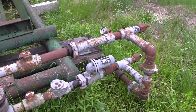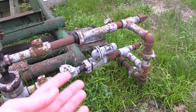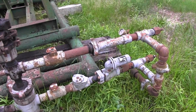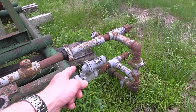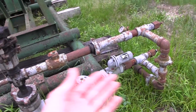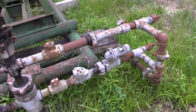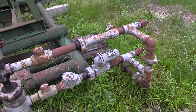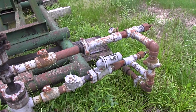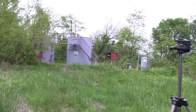This stuff can be organized in a lot of different ways, so you can have check valves in different spots. It really comes down to operator preference and how they set up the wellhead. Beyond that check valve, there's another regulator — that's not on every wellhead. In this case, they only want a particular amount of gas flow coming off this well at one time. They don't want it to exceed a certain flow rate so it doesn't kill itself out, flood itself, or get liquid loaded.